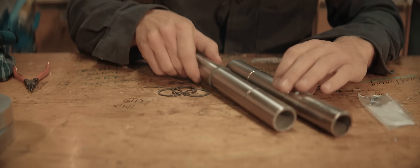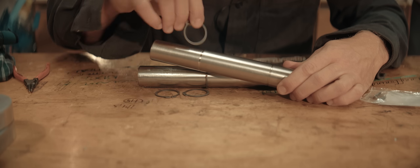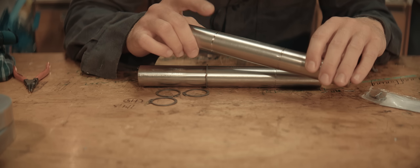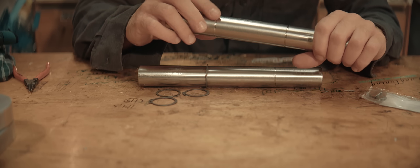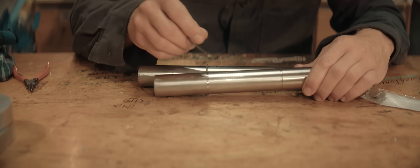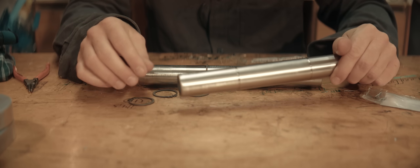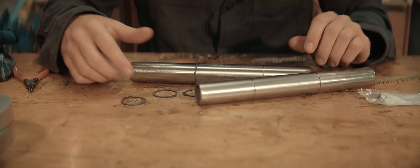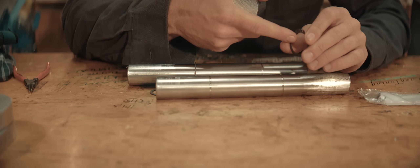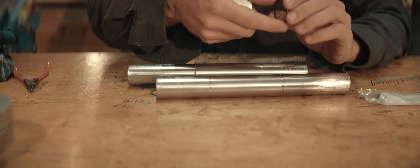Anyways, I did get this done — grooves for these spring clips. The bore on my lathe chuck is too small, I can't fit this through. Luckily I could borrow a lathe from a friend and get it done. This is what keeps the tubes from pushing or pulling out of the bearing housings. Left room for spacers at either end. These rings are too wide and might interfere with the seals or even the outer races of the bearings.